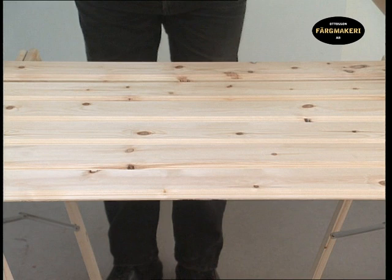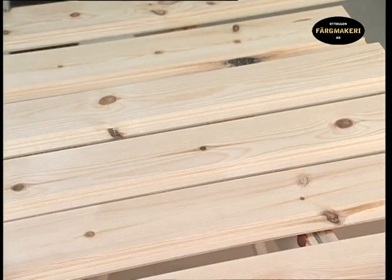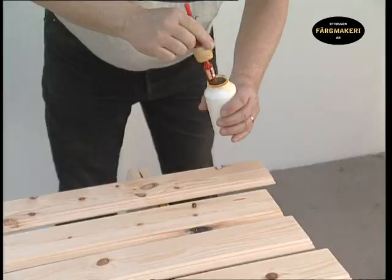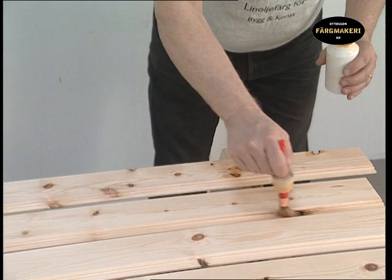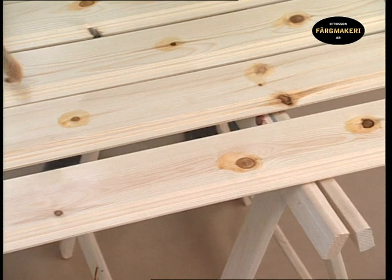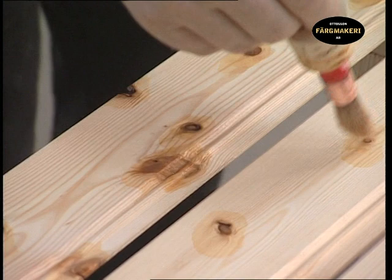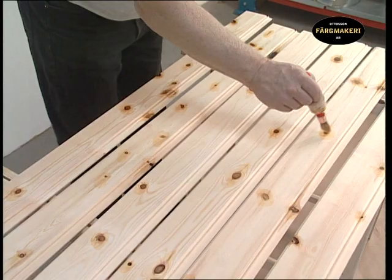We have chosen to apply three coats to achieve good coverage and a semi-gloss finish. Brush off any dust and loose material from the panels. Any planed wooden surface that is to be painted will first require some basic work — any knots must be treated with shellac to prevent the resin from penetrating into the painted surface and discolouring it. The shellac can be poured into a practical shellac set to make the work easier. Apply the shellac to all the knots, then repeat the treatment a second time after approximately 20 minutes.